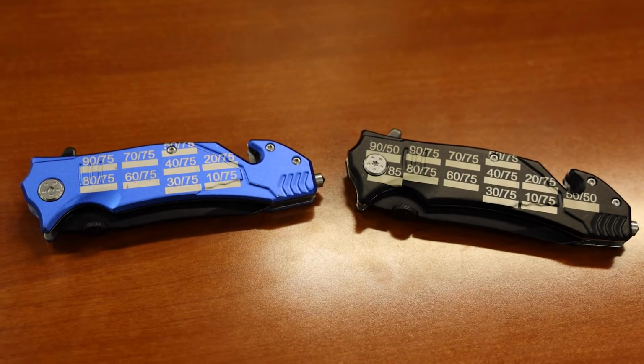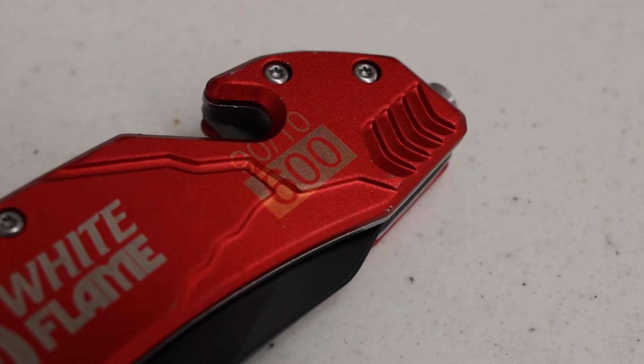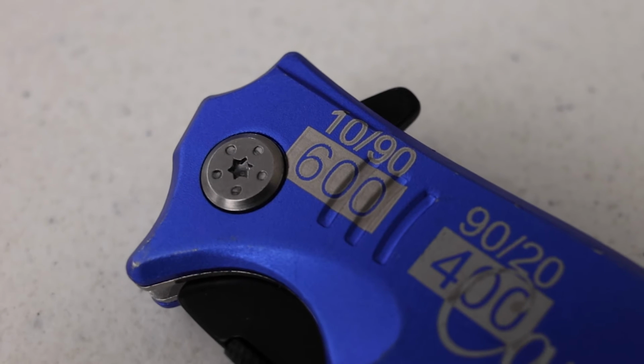The anodized aluminum knives should give you a bright white engraving. Here you can see that you have a wide window of success to get that bright mark. Dull engrave means you're not engraving deep enough. If you're seeing a shadow effect or banding, it means you've gone too deep.